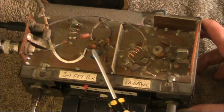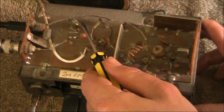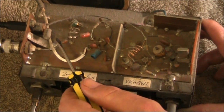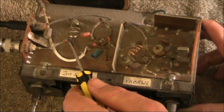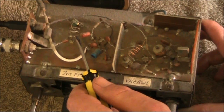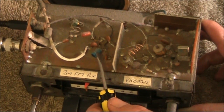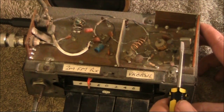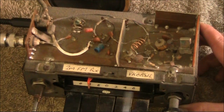On the other side of the partition is a one-transistor mixer. That mixer takes the incoming signal on 2 metres, and there's just a single tuned circuit on 146 megahertz. There's no RF preamp. The product of the mixer is the difference between the incoming signal — say 147 megahertz — and the local oscillator signal at 146 megahertz. That makes for a 1 megahertz difference, which can easily be heard on this AM radio. With the crystal I'm using, the coverage is 146.6 to 147.6, which covers all the repeater outputs and some simplex frequencies.